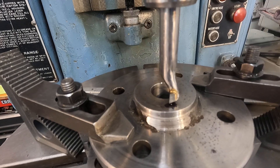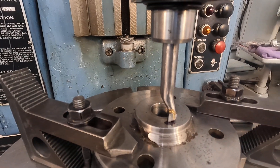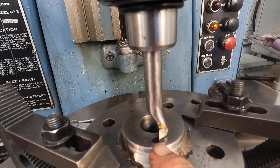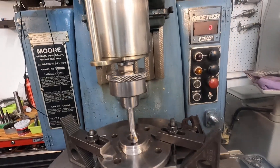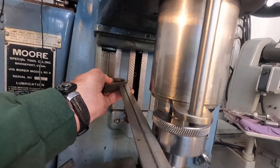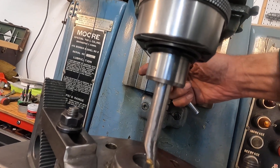The tool's going to have to be turned back. I'll loosen it — okay, it's loose. I'm going to just rotate that tool right to the center of that dot. Can you see it? It's right there, right in the center. That's pretty good, and sometimes I just bump it a little bit ahead. I'm going to go ahead and make sure that the head stayed square — it did, it looks okay. At that point I'm going to carefully get that Allen wrench in there and snug that tool in, and I think we're good.